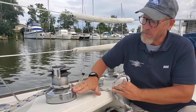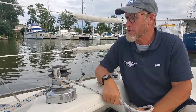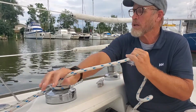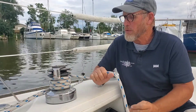The base is meant to feed the line up to the drum — that's why it's slanted like that, to feed the line up and then around the drum. In light air you can get by with one or two wraps. In heavier or medium air you're going to give it two or three wraps, and then if it's really picking up out there you want to give it about three to four wraps.